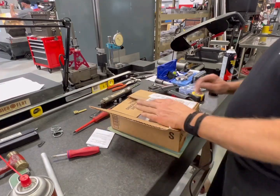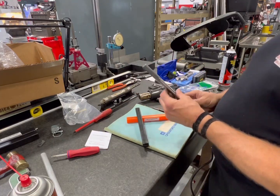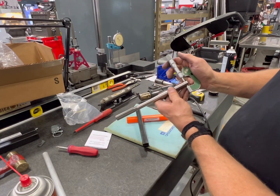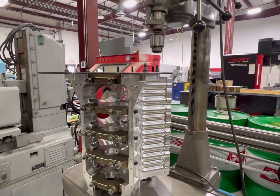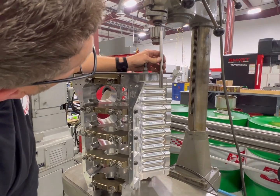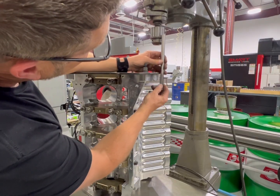I've got the motor plate mounted on the block, and that hole where the alignment dowel is is going to be my guide. I ordered a reamer from MSC for the specific size of the dowel I'm putting in this hole — but here's the problem: number one, it's too long; number two, that center part I'm going to use as a guide is only a 495 hole, where the dowel is 565 thousandths in diameter. So I'm going to have to do some whittling on this reamer.